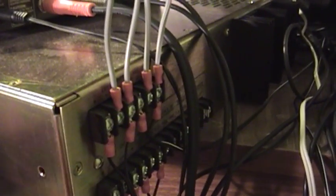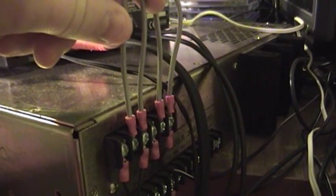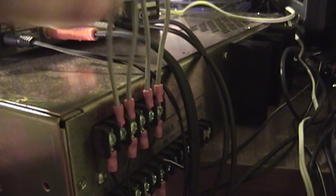Here's a look at the back panel of the unit near the audio connections. There are a lot more than just audio connections back here — it's actually possible to control a number of this unit's features using remote trigger signals. There's also an output where you can tap this thing's 15-volt power supply to operate other devices, within this thing's power supply limits. This unit can accept either balanced or unbalanced audio inputs via screw terminals. I'm running an unbalanced input setup, and as per the CRL manual, I've shorted the negative portion of the signal and the ground terminal on the input side since I'm not using a balanced setup.